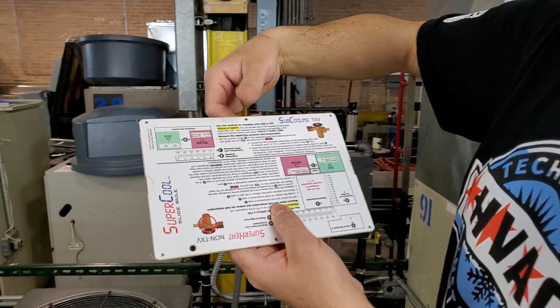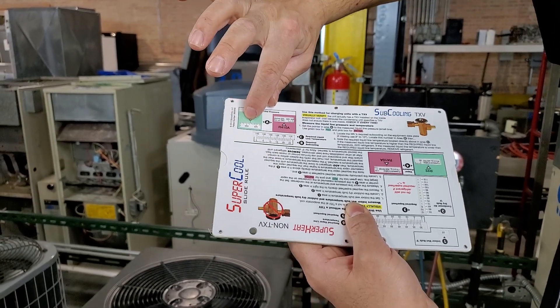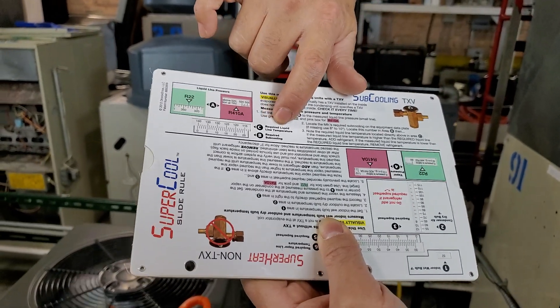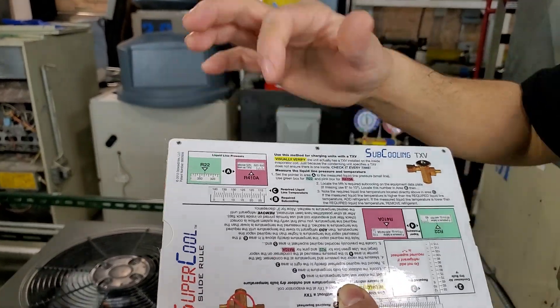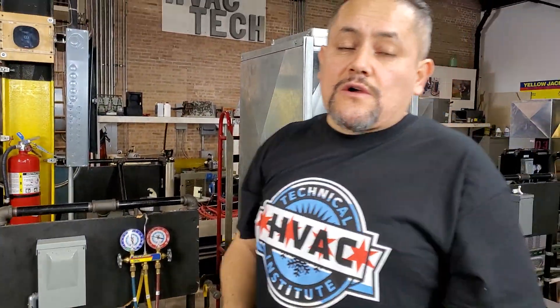That's something really quick. Hopefully you guys understand these basic steps. Maybe later we can do another one and try to do the sub-cooling. At the same table, it actually gives you the sub-cooling as well. This is easier because there are only three or four steps. For sub-cooling, it uses the liquid line temperature. Step A: find the system pressure for R22. Step B: required sub-cooling — you'll be using 10 all the time. Step C: required liquid line temperature. Match them and it tells you what temperature the liquid line should be, and you connect your thermometer to the liquid line instead. I'm giving you guys this video especially for my night class students. If you have any questions, you can text me. See you guys later and take care.